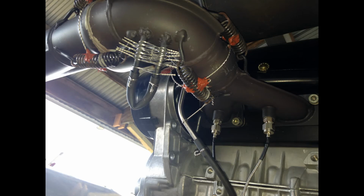If you want to know more about this subject, you can do a general Google search. There's some real good information to be found in discussions surrounding 2-stroke racing motorcycles. Those guys actually want to inject water into their exhaust, and they sell tanks and little computer controlled pumps that monitor RPM and do this on demand in order to tweak their power band. And that's a whole subject that I should have been aware of, but was not, before I installed the ports in this location. So, lesson learned.